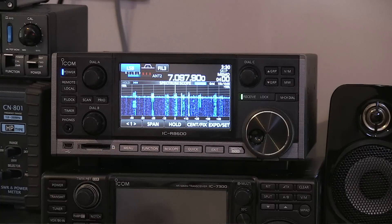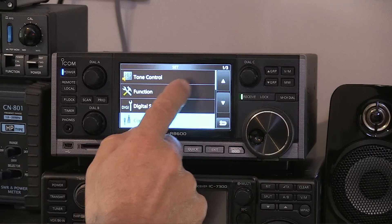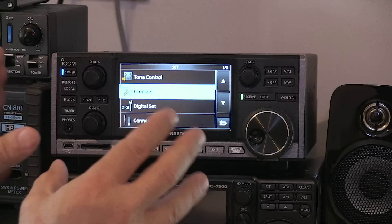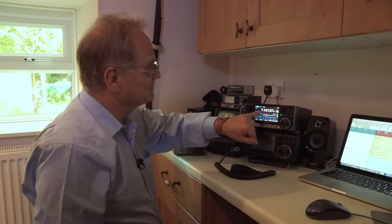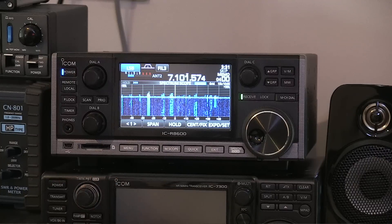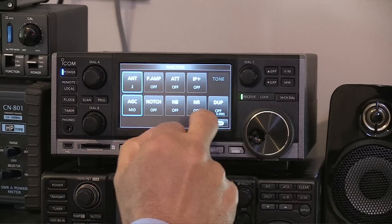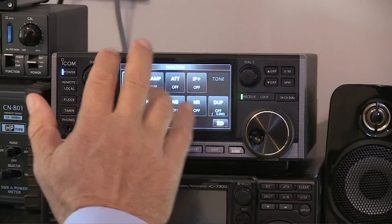There's a row of buttons along the bottom. The menu offers more advanced settings — for example, settings for connectors, notch filters, external devices such as computers for digital decoding, or remote control settings. You can also change the size of the digital display relative to the waterfall by tapping expand, giving you smaller numbers and more waterfall. The noise reduction is very effective — with a high crackly noise level, enabling noise reduction really drops the background. There's also a very effective noise blanker against pulsed noise.